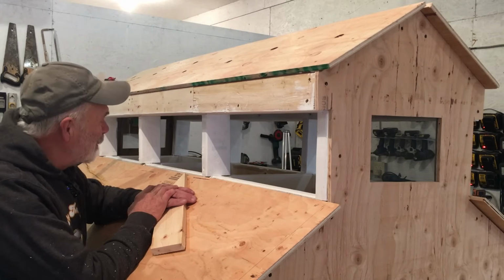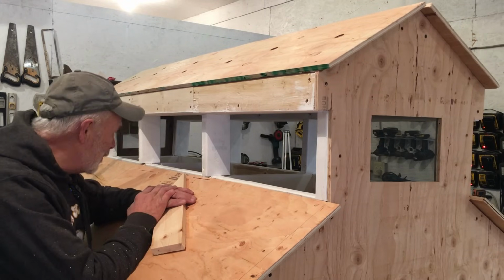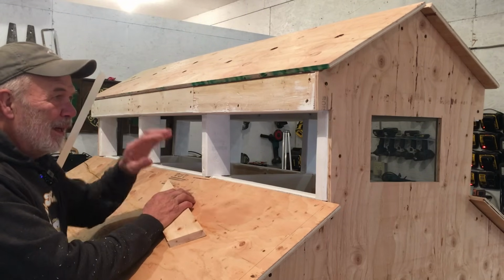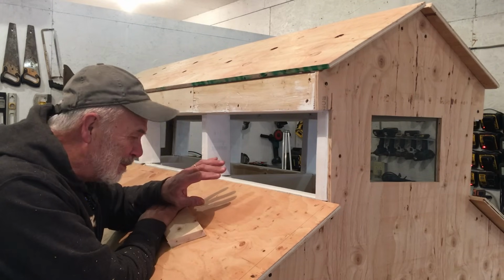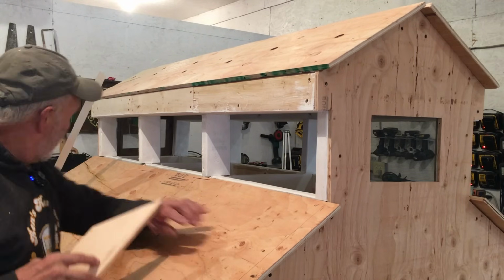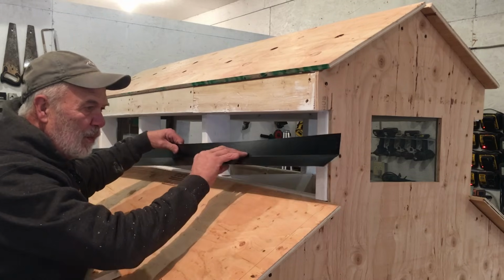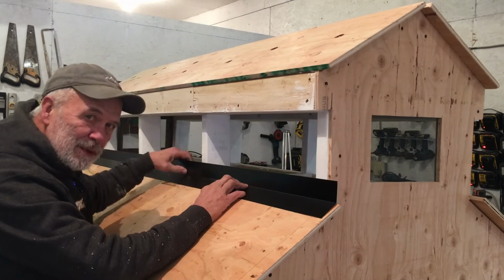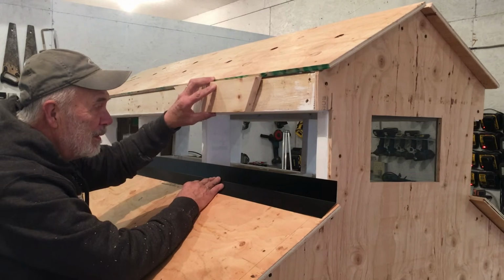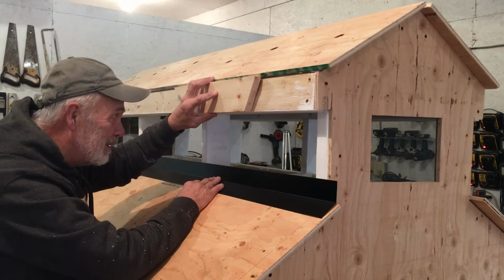It's ironic. I'm at a crossroads right here. It's the proverbial which came first, the chicken or the egg, which is also ironic because I'm building a chicken coop. But painting, I want to paint. I'm a little bit of a sloppy painter, even though I try not to. And so we're going to have roof wrap and shingles. And then I've bent out on the metal brake this flashing that has to go on above the shingles, which is fine so far. That's not a problem. But then we're going to get fascia on here that's going to be white. And if I paint it ahead, that's okay.